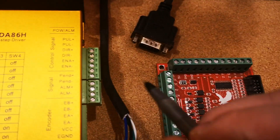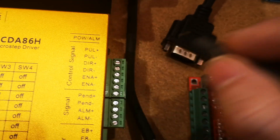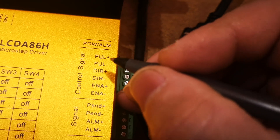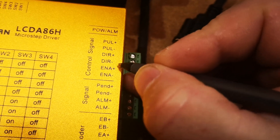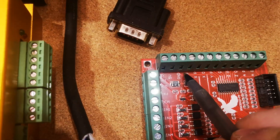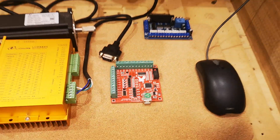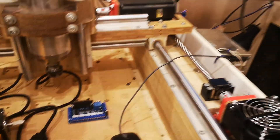What I did was switch them from the negatives — I took the outputs and put them on the positives, then tied the negatives together and ran the negatives to ground. That fixed it. So that's what happened in a nutshell; now I'll go through some more detail.